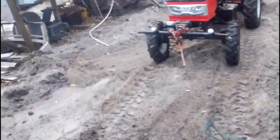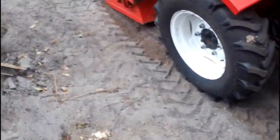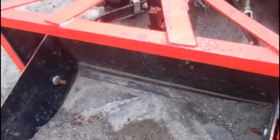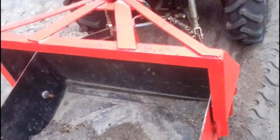Okay, well I think that's enough dirt out of here. I've gone a bit low where the tractor's parked, so by the time I back blade the rest in, should be a level enough area to store the engines on. Being a tip bucket, I need to work out a way of holding the bucket down so that I can back blade with it. So I'll drop some logs in behind it, lift it up, tip it, put a few logs in behind it, and then I should be able to backblade with it. And we'll get this nice and level, and that'll be the next job.